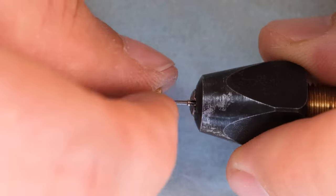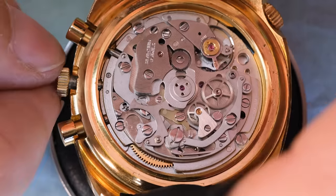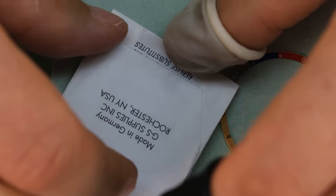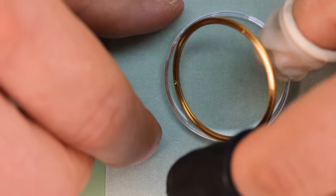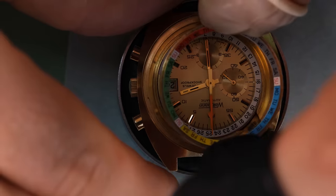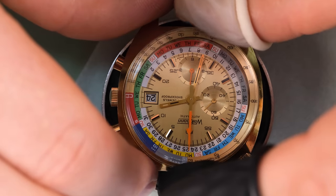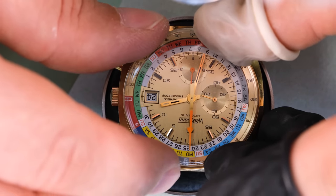After putting on all the hands we're also going to change the crown, as the original is very worn and difficult to operate — so we found a good replacement and put it in. Benson managed to find replacement crystals for the watch from a company that makes crystals no longer in mass production. Unfortunately that crystal was just a tiny bit too wide, and after trying to fit it, it cracked a little. Benson will send new crystals, but for now I simply decided to put in the old crystal — I cleaned it up a bit so it looks good.